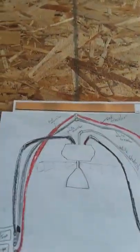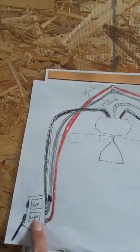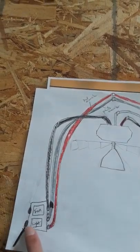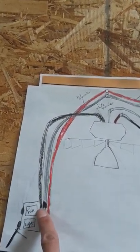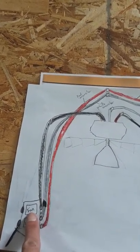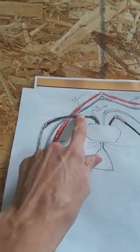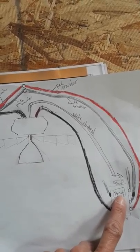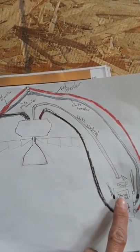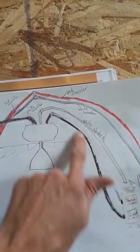I have a picture here. So the fan is going to be my top piece, the light is my bottom, power coming in, and then we have a red wire, white wire, and black wire. The black wire is going to hook up to the top screw for my fan, and then the white wire and red wire are going to be travelers that go up and connect together, leading to the other switch. We have a porch light and power that goes into that running the porch light independently.